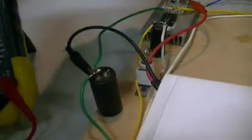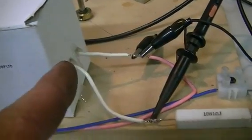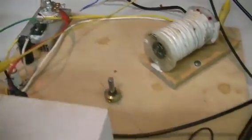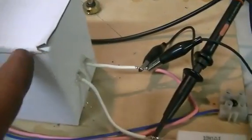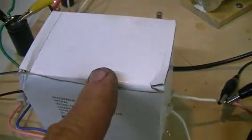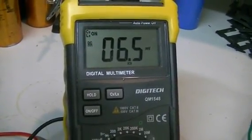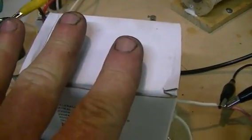Now we are going to bring the cap in. Remember, everything here is after our CVR and our globe - that is the first line of attack. Using electron current flow, we know all the electrons are flying from the negative, going through our CVR, through our light bulb, and then into the rest of the system. So all of this from this box back is behind the CVR and the globe - whatever is going into the system has to travel through this CVR and the globe. We have now hooked up the cap. You can now see that the light output, or the dissipated power from our light bulb, has severely dropped.